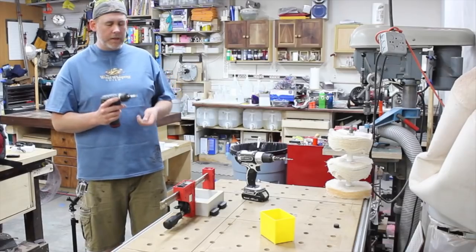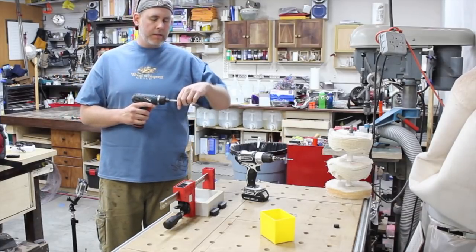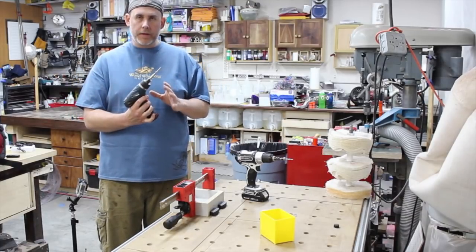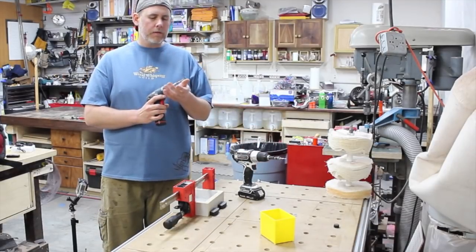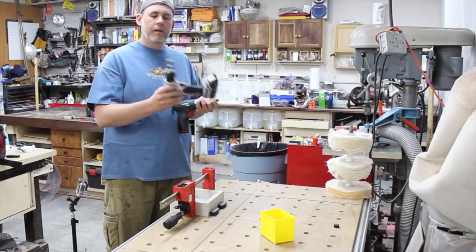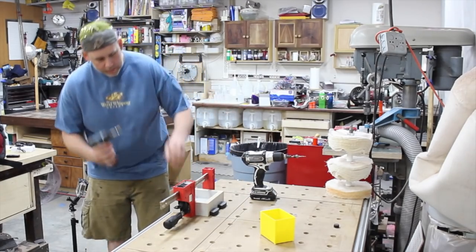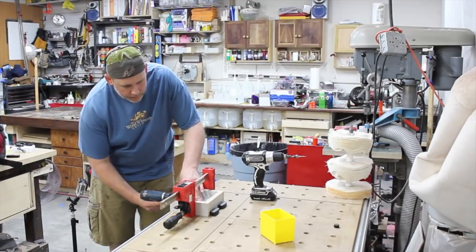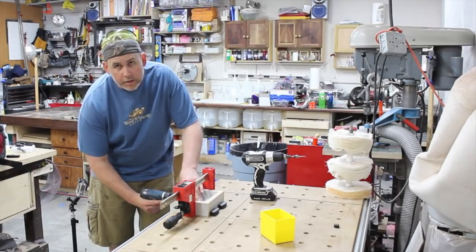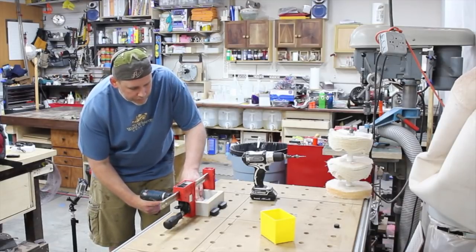And like I said, what I have this set for may be slightly different because this is kind of a weaker, different thing. I'd probably put it on 8. I think they're about the same. I have a Makita, and I would probably use about 8 on this thing too. So either way, just make sure that you don't have it set to a really high setting on the clutch. Let the clutch take over so you're not stripping out the particle board.